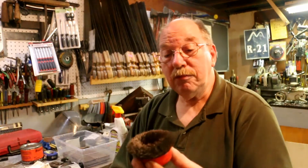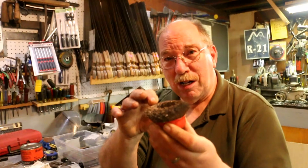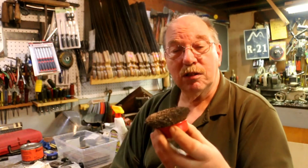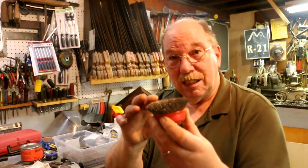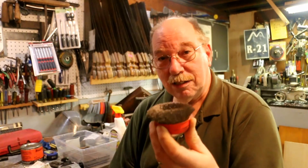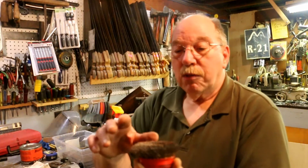The reason for that is metal fatigue. Take this cup wheel, for example. Every time this wheel turns, every wire that hits the part bends just slightly, depending on how much pressure you put on the wheel and how much you're trying to remove the rust. The tendency is to push harder. Pushing harder makes it so that the side of the wire ends up cutting on the steel — or removing the rust, scratching it. It's a single point tool with a whole ton of single points.